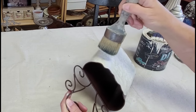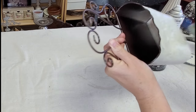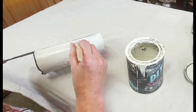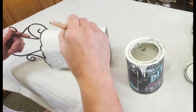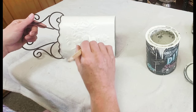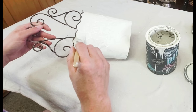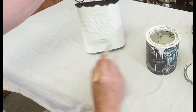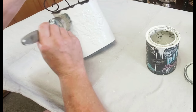For this I'm using DIY's Crinoline, which is an absolutely beautiful ivory color. I painted it on with my brush and then went back over it with a different brush to stipple the paint, giving it a little bit of different texture rather than brush strokes. Here I'm just putting on that second coat of paint, and then I took a little bit of water to reactivate the paint, gave it a good spray, and used that other brush to stipple.